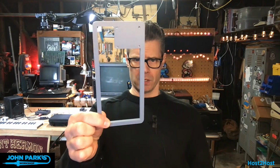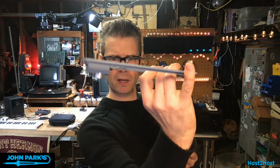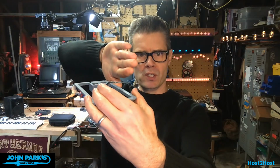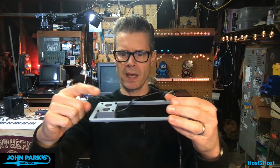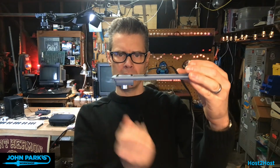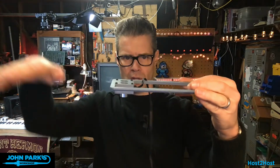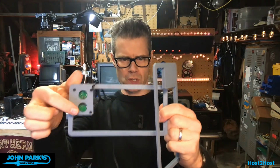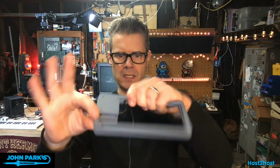One of them is I showed this on Show and Tell last night, but I want to talk a little more about this newly printed backing for the Espresso Tank ultrasonic sensor. Previously, I had been dropping the sensor down on top of there, and then I was going to build a cover for it. I realized I ran out of room, because you might have seen last week when I had my espresso machine water reservoir tank open, it hinges down and it just cleared the ultrasonic sensor, but I couldn't put a little additional case on top of it. So I instead mounted one underneath, and changed the design a little bit so it sits under there. This is flush with the top, and I'm just going to transfer it over to this one, because these holes are just an artifact from the previous design. So it'll look more like that and give us at least a little bit of splash proofing there.